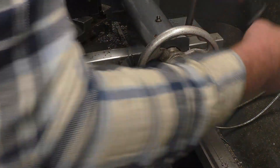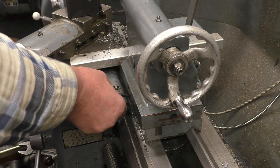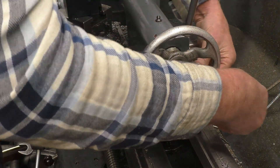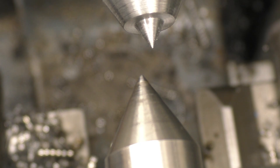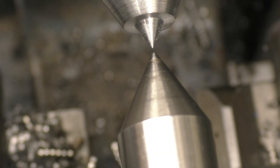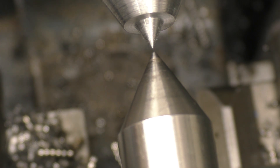So to make it go across that way we loosen this one off quite a long way, and we tighten this one up, and that pushes the tailstock away from me back into position. So once they're lined up that gets you roughly in the ballpark, and then we can do some measurement to make sure that it is absolutely right. Right, so that is fairly near — as near as an eyeball. A little touch more I think. Right, that looks good.